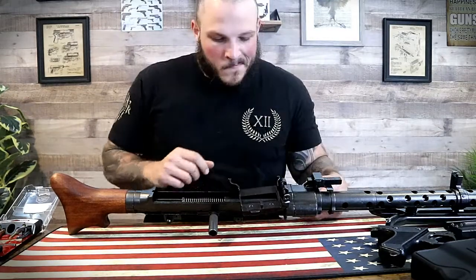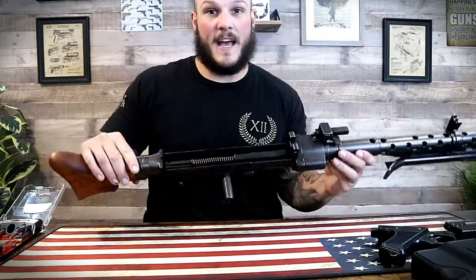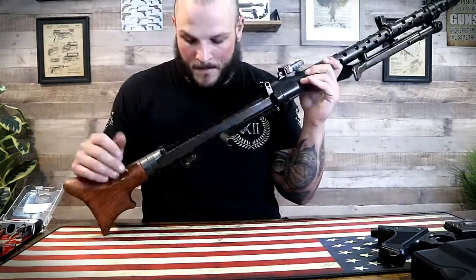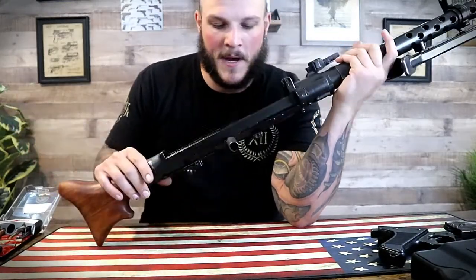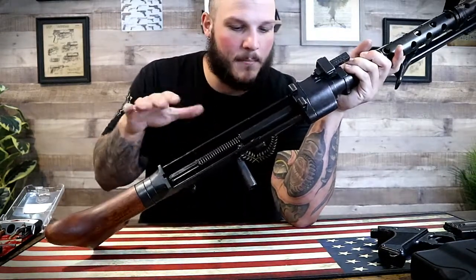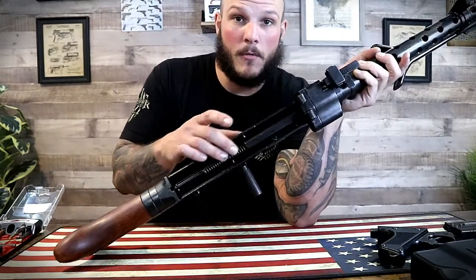Top feed cover. Once we remove that, now we can remove the guide. Now inside, you see we just have a bolt. There's no catch to catch it right now. Two flathead screws down in here. You, again, can't really see them, sorry. You can take my word for it. There's two flathead screws in here to try to match the time period, World War I, World War II, in between. Next step's going to be to remove the bolt.